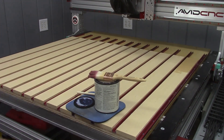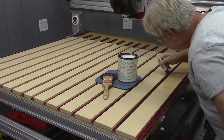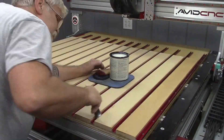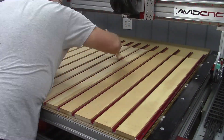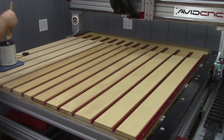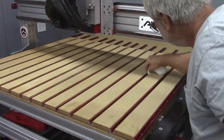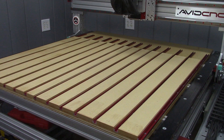When I first started putting it down, I went with a bristle brush and a small foam brush for the edges, but I quickly abandoned the foam brush as it just wouldn't hold enough finish, especially for a first coat — that MDF is very, very thirsty. The spoil board will get a total of three coats, and I let the sealer cure overnight before applying each successive coat.